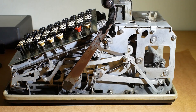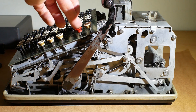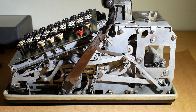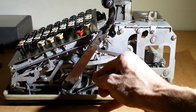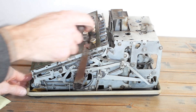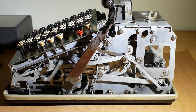I'd already been through the machine, cleaned off the old automotive grease, and oiled all the pivots and bearings. After much head scratching, I found tucked behind this lever here there was another pivot. When you press the total button, that little lever on that pivot should move to the upward position, and there's a little peg here that will actually interact with that to engage the accumulator into the rack when you want a total. But that lever was stuck in the down position, so you weren't getting a total. Here's some footage from when I initially looked at the machine — you'll notice how that lever doesn't move at all; it just sticks in the bottom position. Once I cleaned and oiled that, everything's working fine.